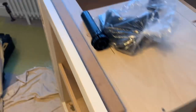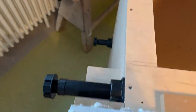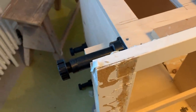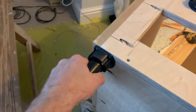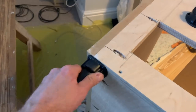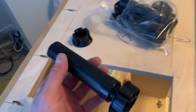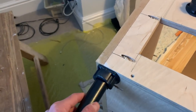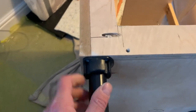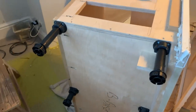The customer would like us to match up the skirting — refit the same skirting profile across the front, which is about 60mm taller than what we had before. So the whole thing's going to have to raise up, and we can pop these 100mm feet out, which is what we normally use. Luckily we did have some 150mm feet of the same type — they're called PEMS feet from Hart Wholesale. They're the only ones I could find that have this squared-off top, which just works for the way we like to fit them. So swapping them out.